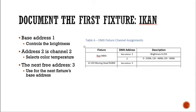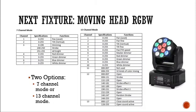The next free DMX address is address three, and that'll be used for the next fixture: our 12 LED moving head RGBW lamp. We'll have to consult the documentation for this one. We notice it runs in two modes: seven-channel mode and 13-channel mode. In seven-channel mode — sort of the bare-bones one — you've got pan, which is horizontal movement, and tilt, which is up and down.